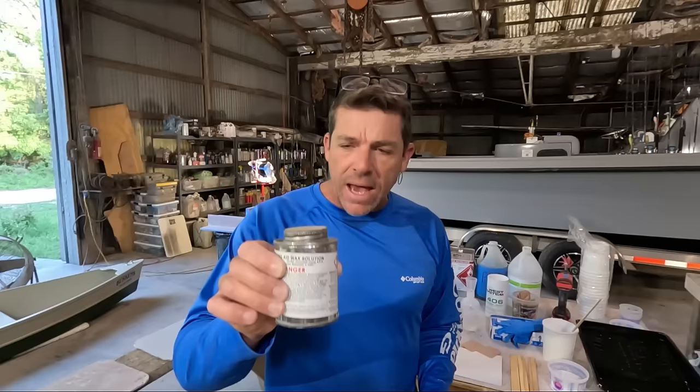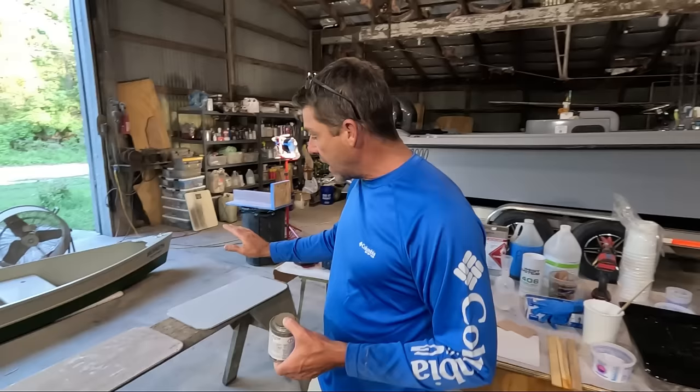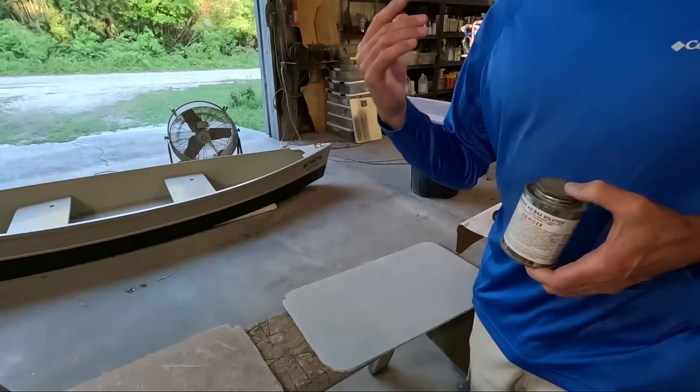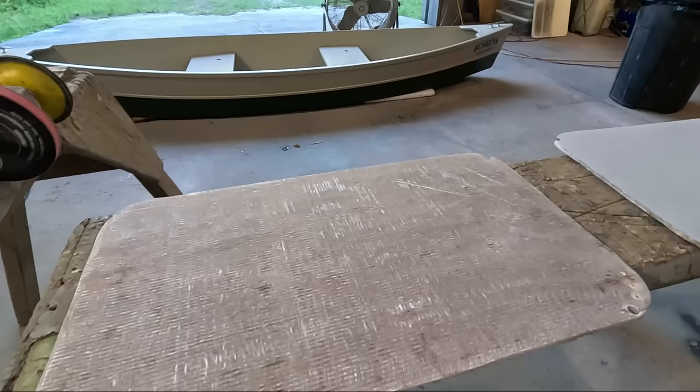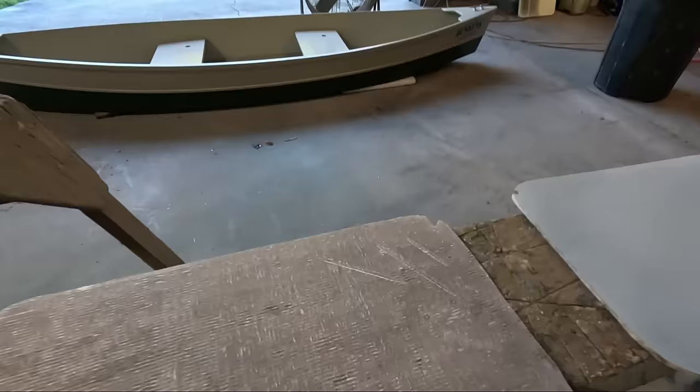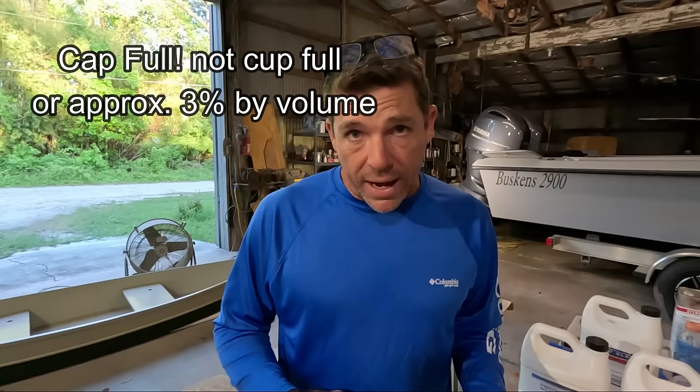What I thought I'd do today is work with a variety of samples. I've got a panel here as if you had an older boat and wanted to put gel coat on it — this has already been sanded and cleaned for the sake of time. We also have another panel with more of a raw fiberglass surface, as if you had fiberglassed over a floor or a deck. We've also put some gouges and scratches into this to demonstrate what you might do with gel coat in the case of minor scratches — you can fix those with a thickened gel coat.